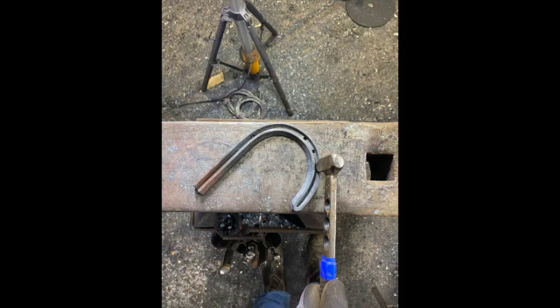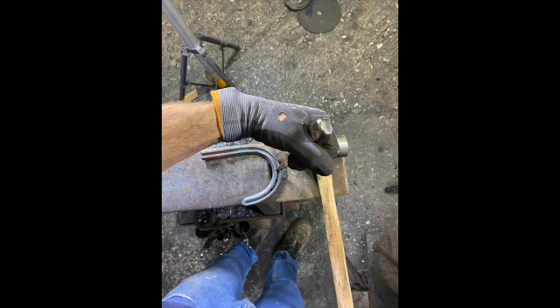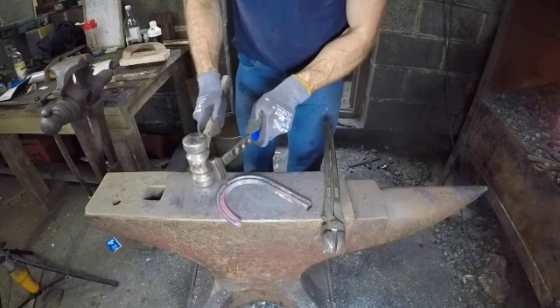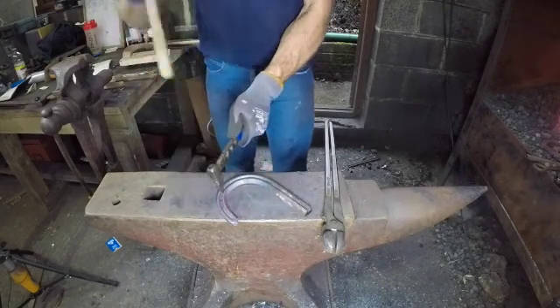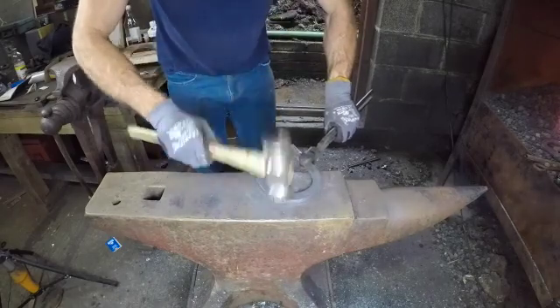Now onto the nail holes. Holding your stamp, I always want you to hold your stamp near the hardy hole. I'm right-handed so I always hold it to my right-hand side using my left hand — I don't switch sides as in this picture, which is wrong because holding the stamp like that will give you different issues. Holding the pritchell, you need to hold it all the way round. If you hold it as shown incorrectly you will not be able to see what you're doing and this is how you end up smashing your pritchells. First the toe nail with maximum pitch — a couple of good firm blows using the round of the hammer onto the stamp. Then place the heel nail at the widest part of the foot, which should be the centre of the shoe, and then one nail hole in between.